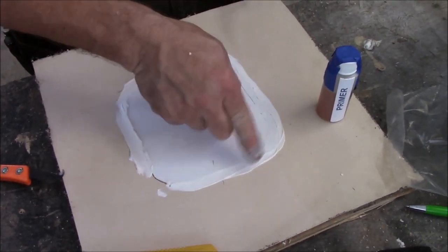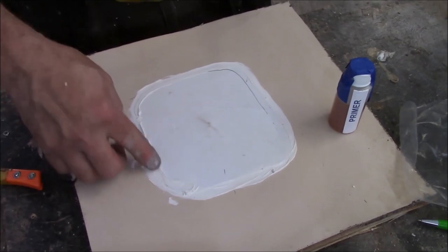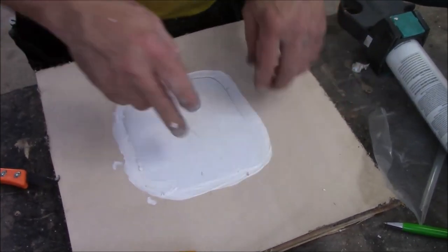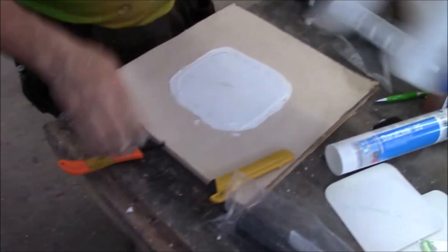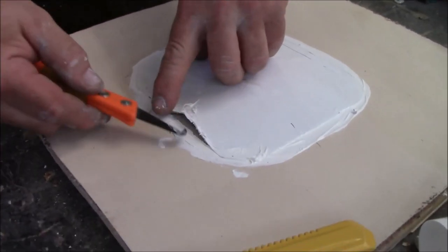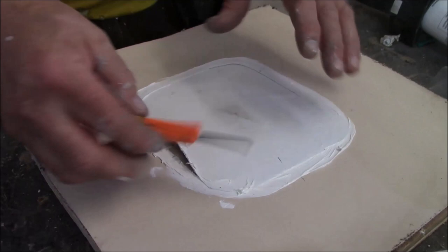We're trying to obviously stop a leak. There's going to be a little more permanent of a patch than just that plug that we did when it was raining. So now that we got that all done, the whole purpose of it is this part here. This part underneath here, that's a butyl. When the sun hits that, if you didn't have the caulking on there, it will cause it to release and curl up just like I'm doing here. And it'll start coming loose.